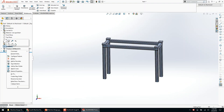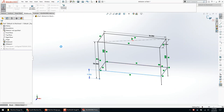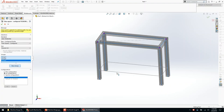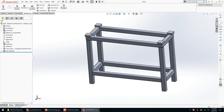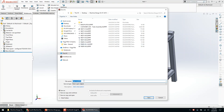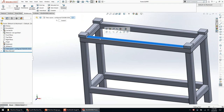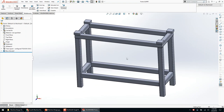Perhaps I want some tubes down low because that looks a little rickety. Adding some geometry, dimensioning it — six inches is fine — rebuilding the sketch, editing the feature, adding a new group, and selecting around to get the same result. Because the sketch and feature updates didn't affect those original faces, those features stayed intact. I should save this before something crashes. Now if I change this two-inch tube to three-inch, or angle iron or round tubing, something will blow up. But as far as a 3D structural steel tube frame goes, they're relatively easy and quick to draw, and once you have one you can modify them very quickly by just editing the 3D sketch.